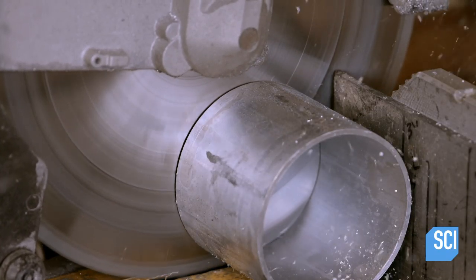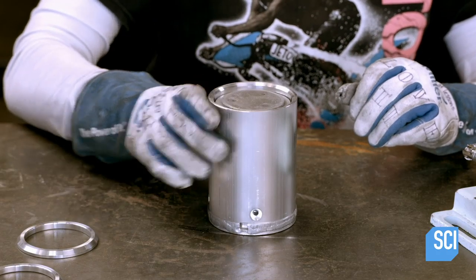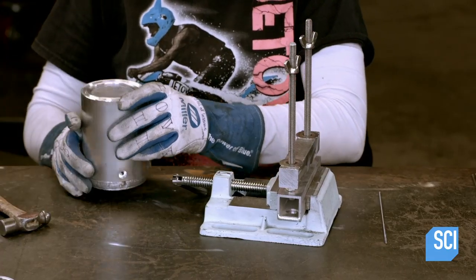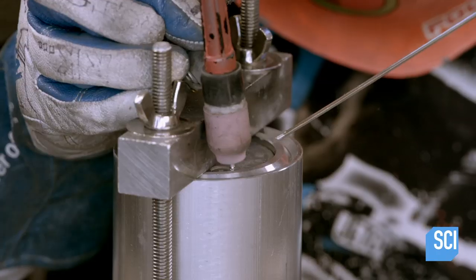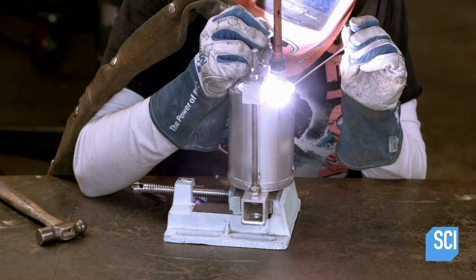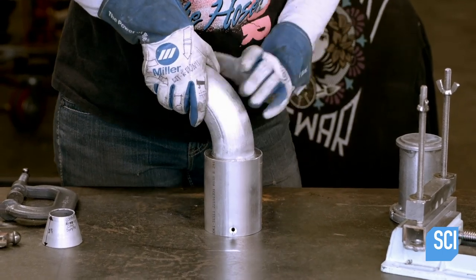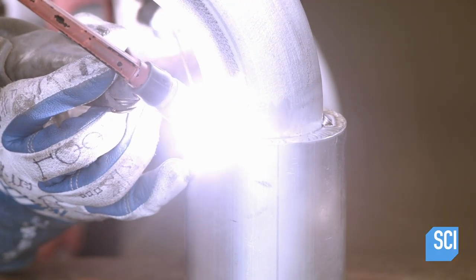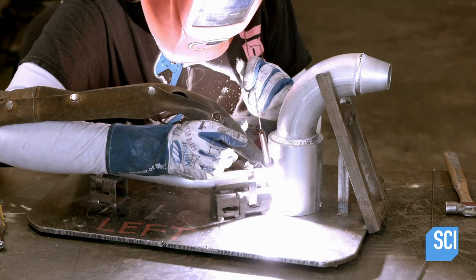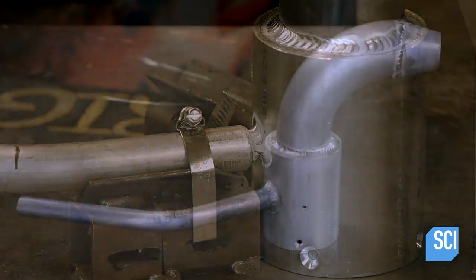This curved tube will become the lifting jet. To build each jet control nozzle, a worker places a housing on an alignment fixture, then hammers an end cap into position. Holding the housing steady with a clamp, the worker welds on the end cap. This housing will cover the bushing at the heart of the jet control nozzle. He inserts an elbow into the opening in the end cap and welds the parts together. After welding a jet nozzle cone to the other end of the elbow, he welds a handlebar to the housing. These five welded parts make up the body of the first jet control nozzle.